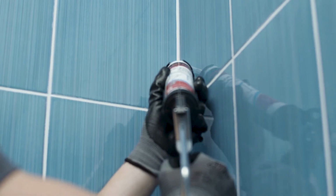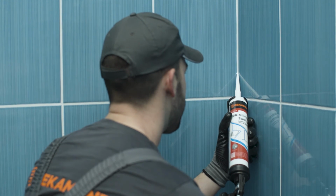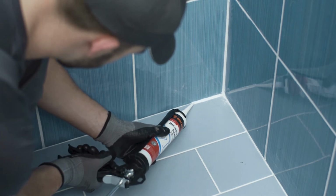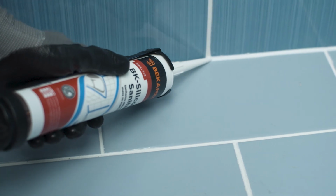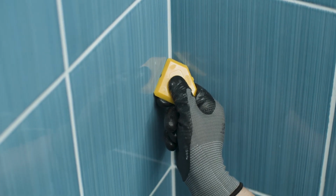In the final phase of installation of the hydroceramic system for waterproofing and laying ceramics, Bekament silicone, sanitary silicone mass for sealing joints, is applied between ceramic tiles in corners where the wall joins the floor, and for sealing joints between tiles and sanitary facilities in the bathroom. It is resistant to aging, shrinkage, cracking, mold, UV rays and atmospheric influences, and it does not change color.